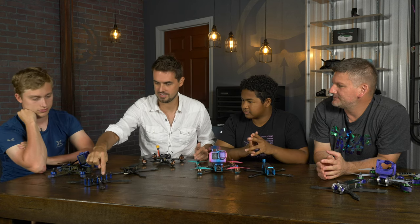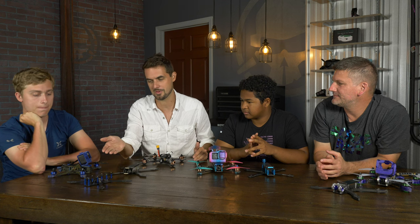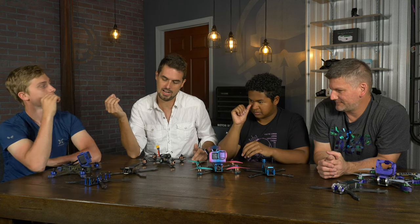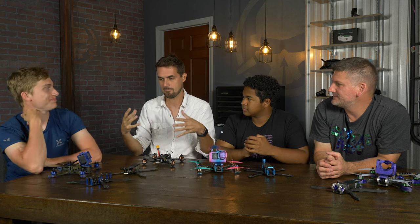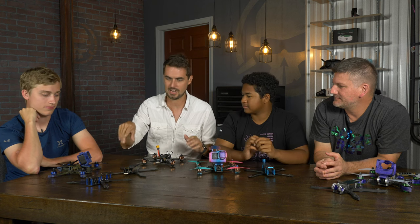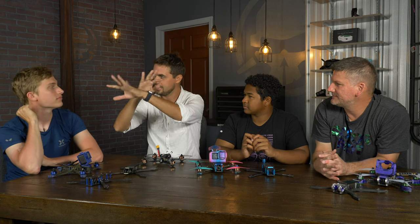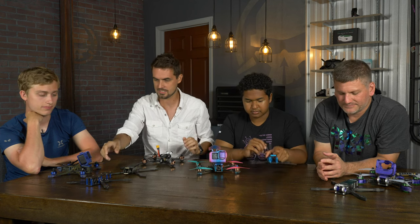I mean, the ones on the top plate, these two V holes, those are probably the only ones that truly serve no purpose. Yep. And I would say I'd get rid of them. Even though you're saying you've never broken a top plate, I know you haven't. It's just like, why introduce that weak spot? Because carbon fiber is a weave, and I want to talk about this more with the arms. It's a weave. This is not a piece of aluminum. So the more interlacing that you can have, the more structural integrity the piece is going to have.